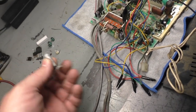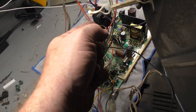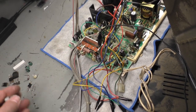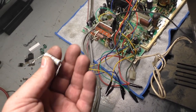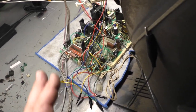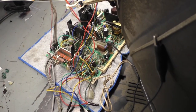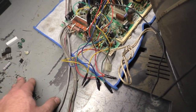So this is the resistor I put in that was missing. This thing obviously operated for a long time with this resistor removed, so obviously it doesn't need to be in there, but I thought it couldn't hurt. But I took it back out, thinking that this was the cause of why it's not auto-discharging. But the auto-discharge isn't important because it's not detrimental to the operation of the chassis, so I'm not going to dive into that. You can just manually discharge it.